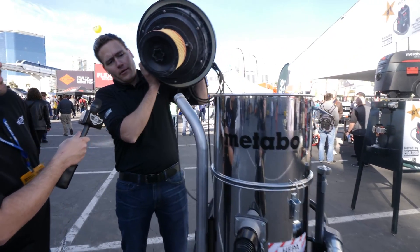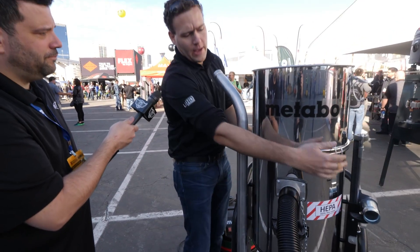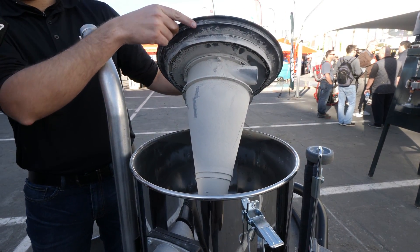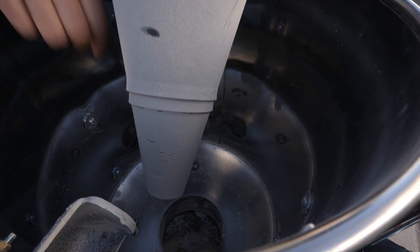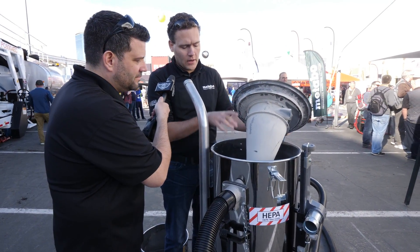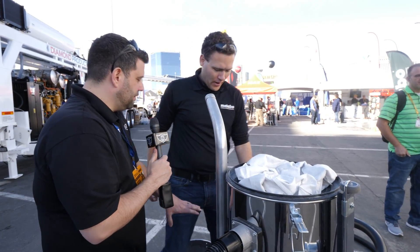You can see here we have our HEPA vacuum filter. We've been running that vacuum for the entire show and there's no dust on the filter. It's because there's some magic happening in here. We have a pre-filter bag that we use to protect the big vacuum — but even the pre-filter bag is empty. There's nothing in there because we have a cyclone — an amazing cyclonic system. As the dust comes into the vacuum, it creates a vortex that throws the dust directly down, and at the bottom it opens and lets the dust down into the bag. You create a double cyclone system outside and inside of this funnel, and that throws all the heavy dust first and then the light dust down. So there's almost no dust that reaches the pre-filter bag, and the pre-filter bag does all the remaining work — which is why the HEPA filter stays so clean.